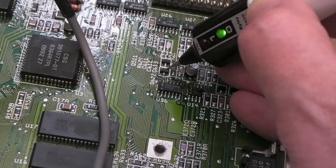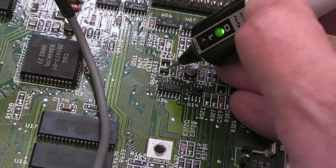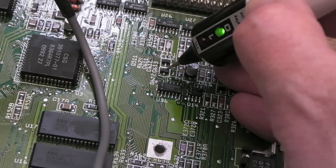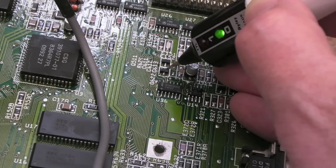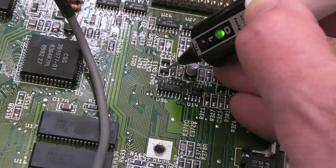They'd swap the keyboard MCU up there and the CIA, probably jumping onto the idea that the keyboard is the clue. But you've got to look at the behaviour as well, in the sense that once you get past the red screen and let it reset itself, and I don't think it is a watchdog, it's actually the CPU that does the reset there, I think, like a retry. It shows the red screen for a period of time, and then you get a reset, presumably done in software. And it works okay, so that was a clue to me, right from the very start of this, that the reset circuitry was probably where we would end up. And yeah, I strongly believe that's what it is.